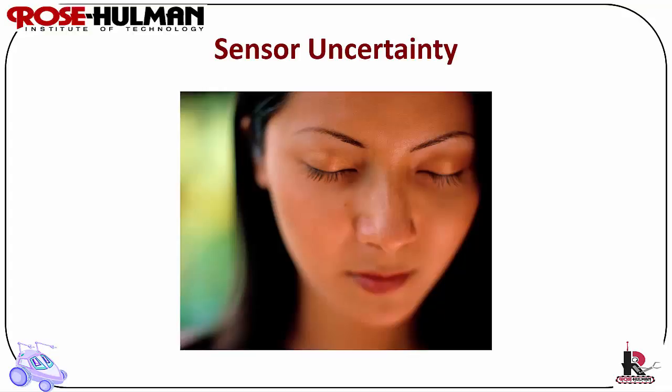Follow it? Move away? Given a sensor reading, what was the world like when the reading was taken? Considering that you have a mobile robot that may have moved by the time it processes the perceptual information from the sensor. This may not be easy with simple or complex sensors, because simple sensors do not provide enough information for reconstruction of the world — i.e., if the bump sensor is triggered, when did it hit? What did it hit? Complex sensors provide the information but require a great deal more processing.